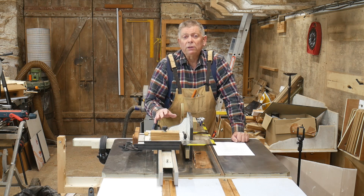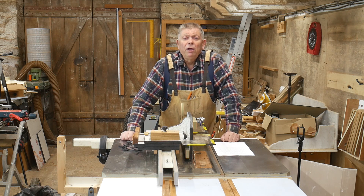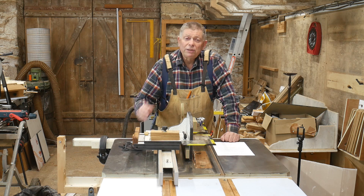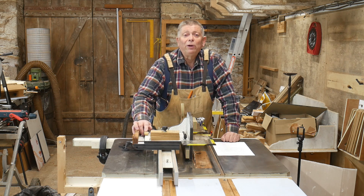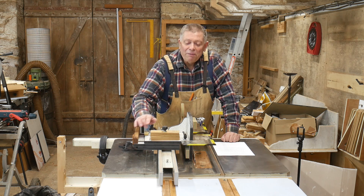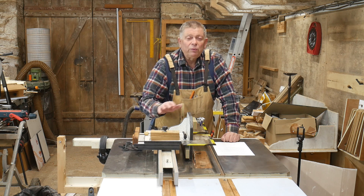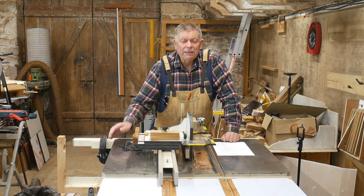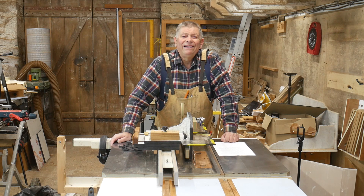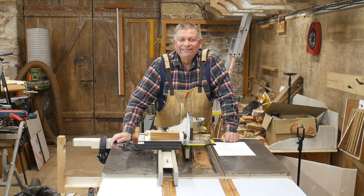All the processes involved are straightforward, so it's not a difficult build. I know it looks complex, but it's cutting, it's routing, it's drilling, and yes there is a little bit of tapping — but tapping is not difficult, and if you really don't want to tap, just embed a nut instead. It will still work just as well. If you want a fancy brass knob like mine, you'll have to have a mate with a lathe — thank you, Andy. And if you want bespoke plastic knobs, you need a mate with a 3D printer. But the truth is, all this hardware is readily available — any flat-faced knob will do, and Bristol levers, toggle clamps, knobs, you can buy them all over the place. None of it is difficult. Thank you very much for watching. Until the next time, cut your tenons right, first time, every time, and enjoy your workshop. Cheerio!